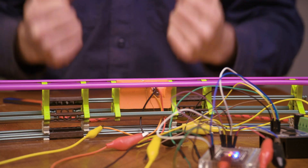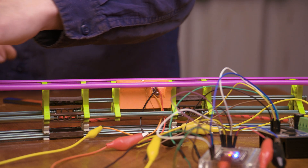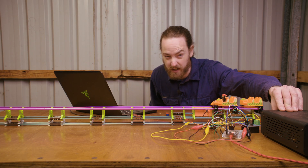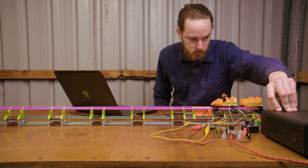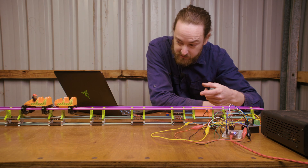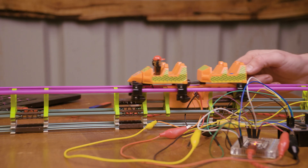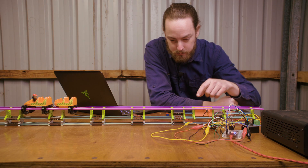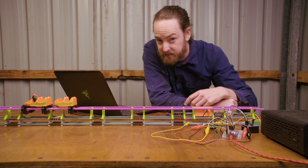Yes! That was awesome. Let's reset. That honestly worked better than I expected. Let's try it again. I'm trying it at 24 volts this time, so hopefully we don't blow it up. Awesome. That's just with one set of coils and only magnets on one carriage, so I think we can definitely beef this up a little bit. I might redesign this motor here to have multiple coils, and then we've got plenty of space, so I might have multiple sets of them in series, and let's see how fast we can make this thing go.